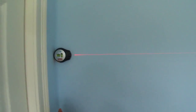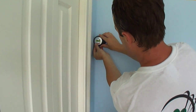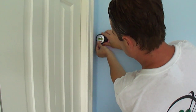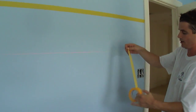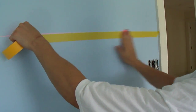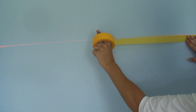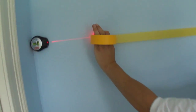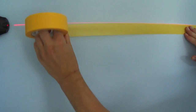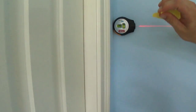I'm not too happy with the way that the bubble is there, so I'm going to turn this off and just rotate it a little bit more. Turn it on — it's right in the middle — and put it to the wall. Now I'm going to put the tape on the underside of the laser line here, put my finger in it like that, and unfurl the tape over there, pull it out and bring it across. Cut it and press the tape down.